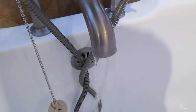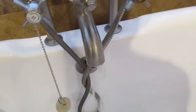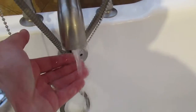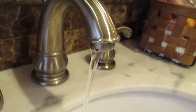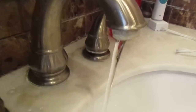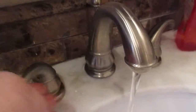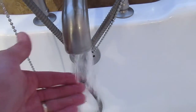It's just dribbling out of the tub. Now again, with multiple fixtures going I would expect some form of a pressure drop, but this to me is pretty low — quite noticeable. Turn the sink off on this one — barely a change. Sink off — a little better flow here at the tub, but not much.